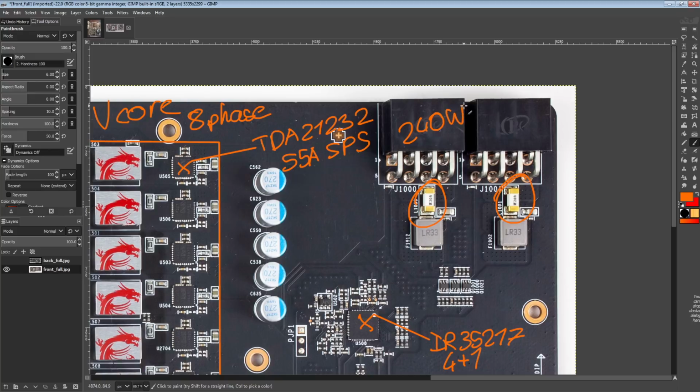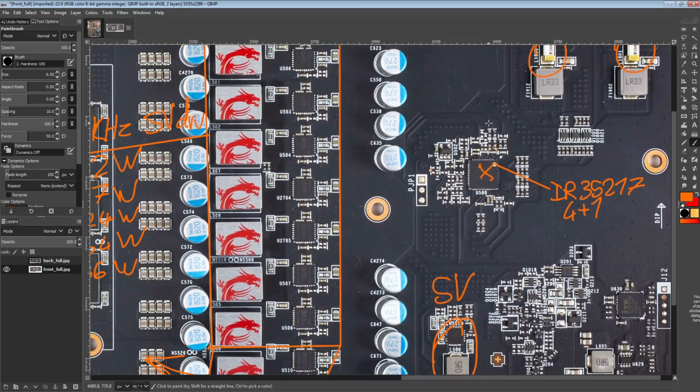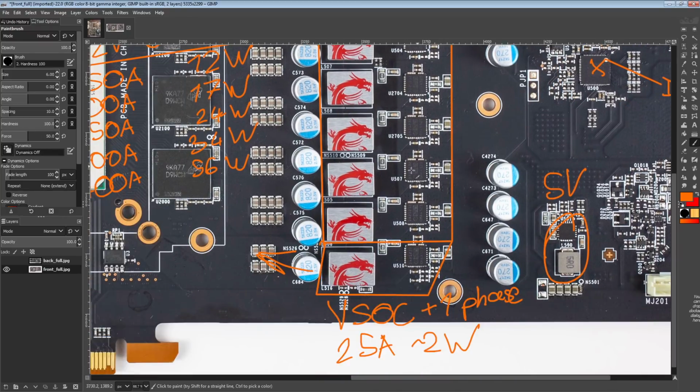That still gives you 240 watts for each 8 pin, so before you risk blowing the fuses while overclocking, you'd already have to be pulling over 400 watts into the card. So the fuses really only get in the way if you're on liquid nitrogen or something and are really pushing it. You'd probably have to have manual control of the controller to run into that being an issue.